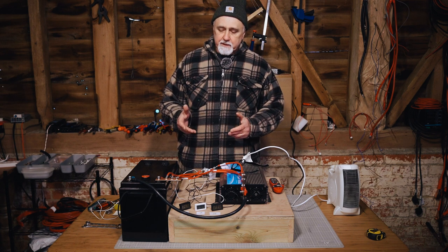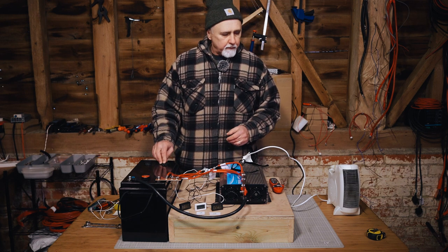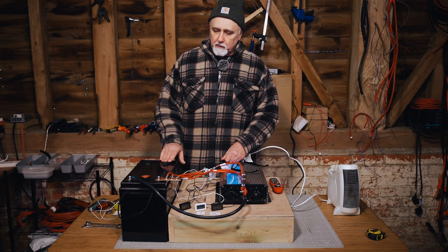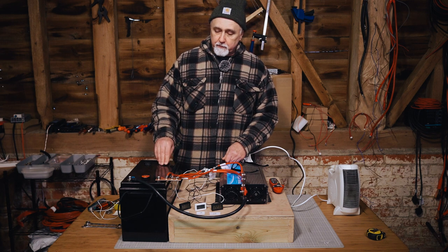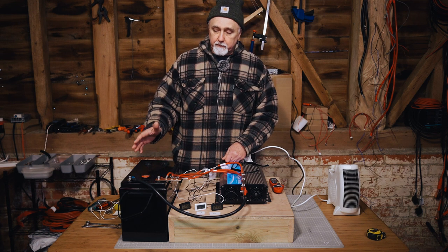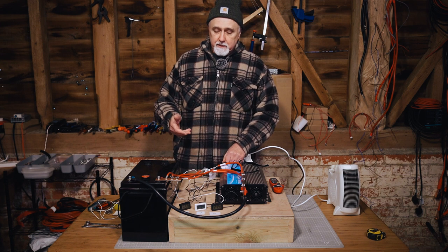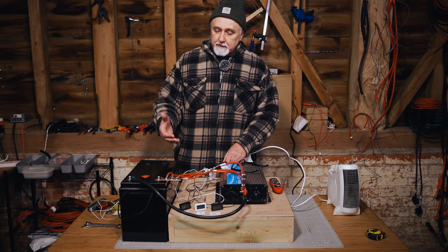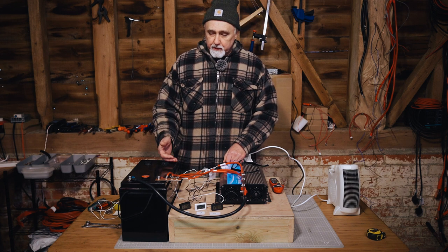As soon as you go above 100 amps — say to 160 amps for a while, which is around about 1.9 kilowatts running a fan heater like this — then you'll start your heat buildup. Luckily, virtually all cells will deplete before the heat buildup becomes too excessive, unless you're in the tropics and your battery is already starting off at about 40 degrees ambient, in which case it's going to heat up quite quickly and you're going to have a shutdown. Here it's about 3 degrees centigrade, so pretty cold — a good test in a coldish environment. It doesn't really matter whether you're at 4, 7, or 10 newton meters; your heat buildup is going to be pretty much the same.